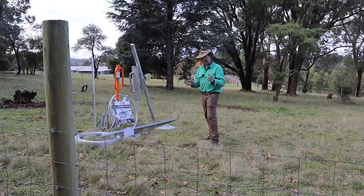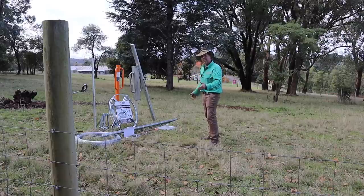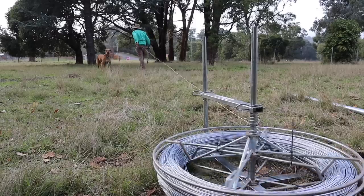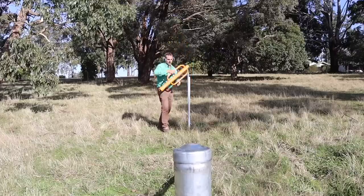In this video I'm going to take you through the process of setting up an internal fence with a gate at each end. I'm going to show you how to account for the length of the gate in your post spacing for your end post. I'm going to show you how to set up your end posts and then show you how to run out ground wire and lay out your posts so that the fence completely lines up.